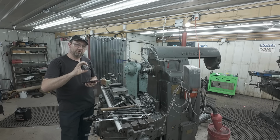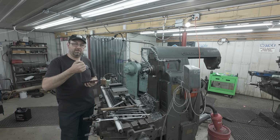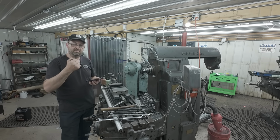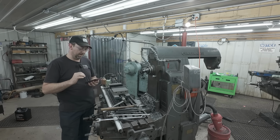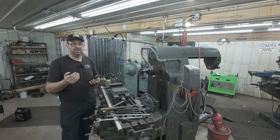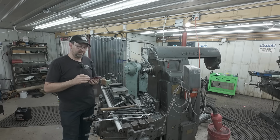So you're using a micrometer to get that. You can use your caliper and that'll measure your depth. So I'm doing a 3/8 depth keyway. That would be 3/8 that depth there, but you still would measure it off the bottom. But there are ways to calculate all that in the machinery handbook. You just got to look it up.